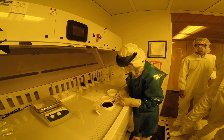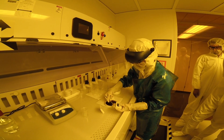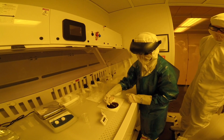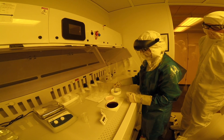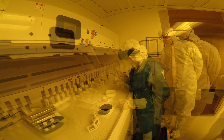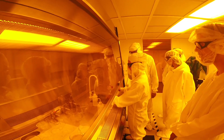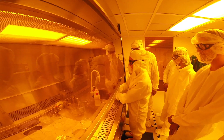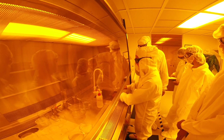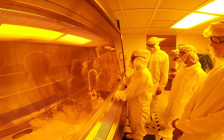The next step is wet etching of chrome. Since this process involves use of harsh chemicals such as hydrochloric and nitric acids, it is strictly carried out with proper PPE as shown in this video. This is the last step of the process. The PR mask is washed away with sequential washings with acetone, IPA, and water, and finally blown dry with nitrogen gas.